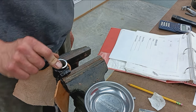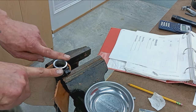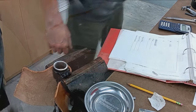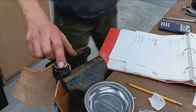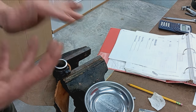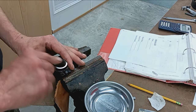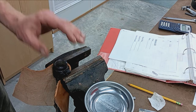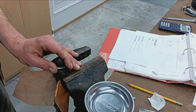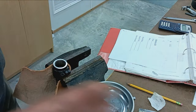With Springfields, there is a given dimension for the length. We've shaved off 4.5 thousandths off the face. Since we shaved off 4.5 thousandths off the face, we're going to go with 730, just to account for that shortening of the face of that receiver. It's a cone breech, as I mentioned, so really there's plenty of clearance because we're going to be cutting a cone breech, essentially.